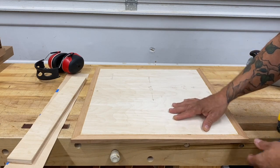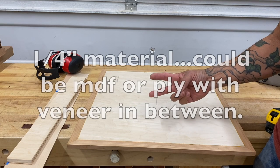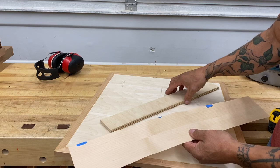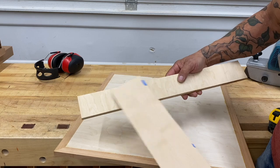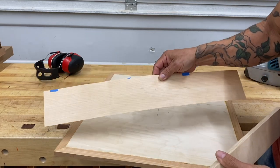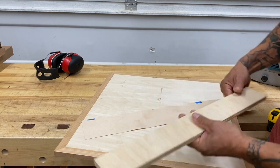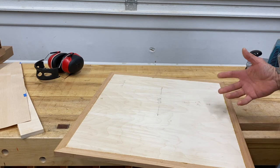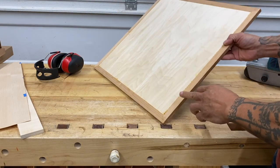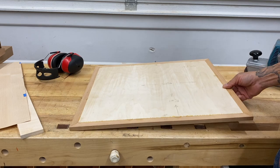This is slightly off subject but still related. I love this process. What I have here is some shop-made plywood — I take two layers of quarter-inch and put a piece of raw veneer in between those two layers, turning the veneer 90 degrees with the grain relative to the two pieces of plywood to keep it balanced. I'm using epoxy to adhere this veneer, and what you end up with is a very flat, straight, strong material. This panel is going to be a secret door, so I need it to be dead flat. By sighting these edges, I can confirm it is very straight and flat.